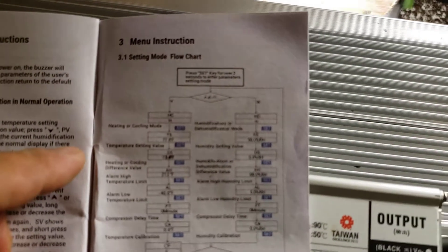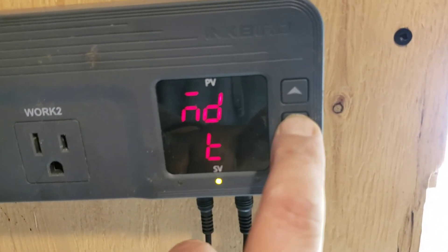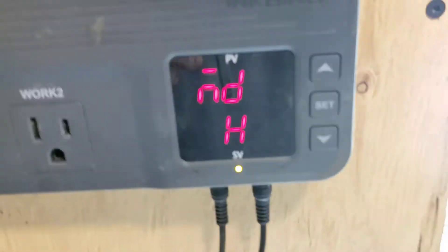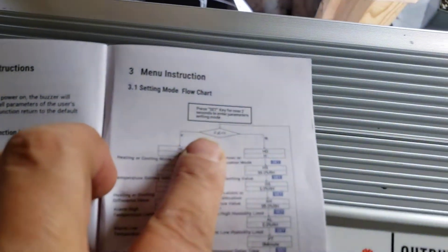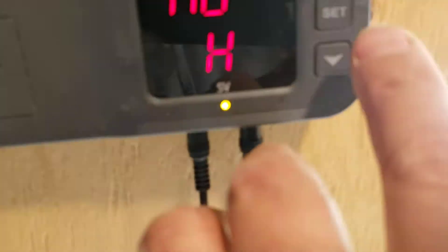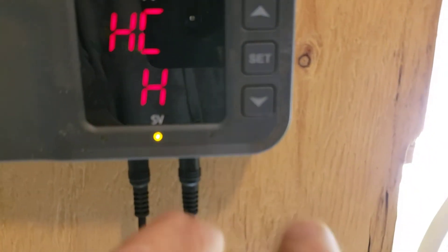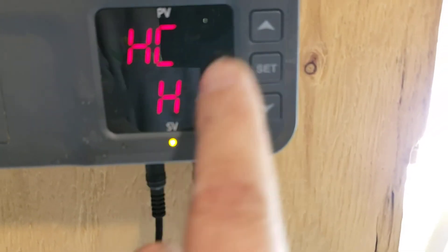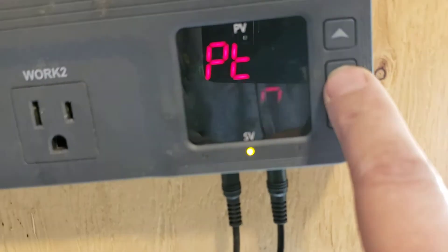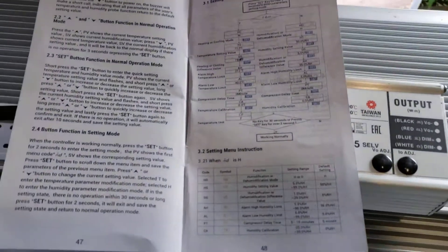You have your humidification and dehumidification settings. One thing that's a little confusing: you press and hold that button. You see that T? That's temperature. If you change that to humidity, you are not changing any mode — you are determining whether you are programming the temperature side or the humidity side. Go up to temperature, click enter, then your heating/cooling function: we're heating, not cooling. You can go through all the different setups, let it sit, it times out, and it goes back into the regular operation mode.